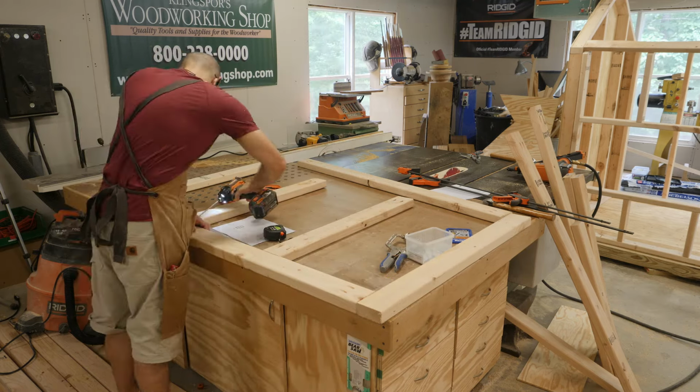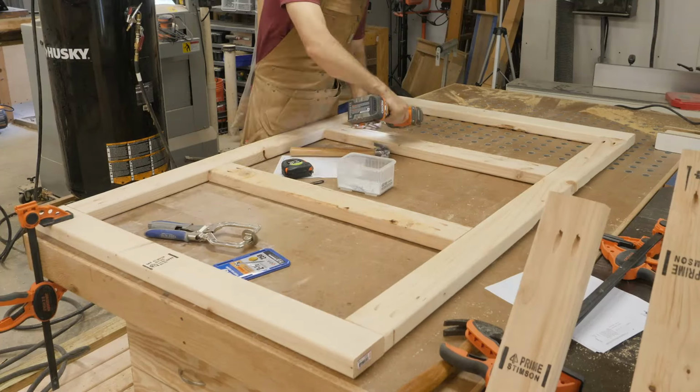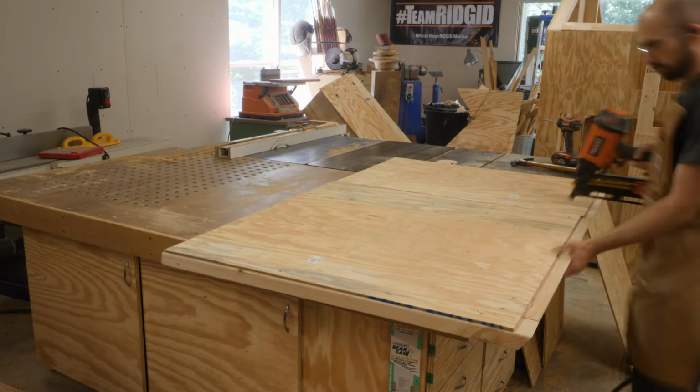To make the roof for this chicken coop, I opted to essentially make a panel for the left and right hand side. As you see, I'm using pocket hole construction again, and then what I'm doing here is I'm cutting an angle so that when each panel comes together on the chicken coop, I have a nice clean mitered seam.